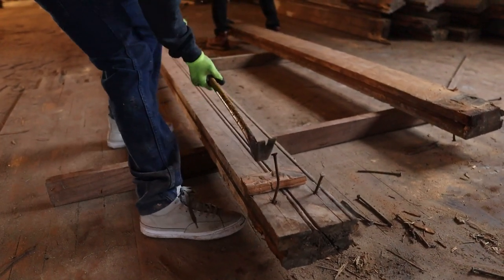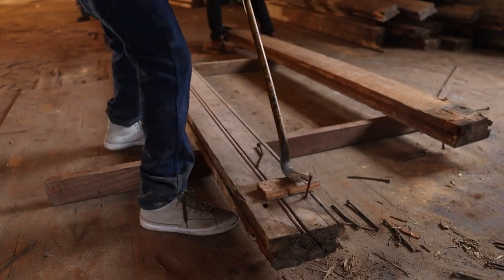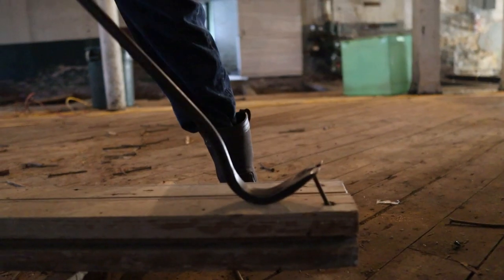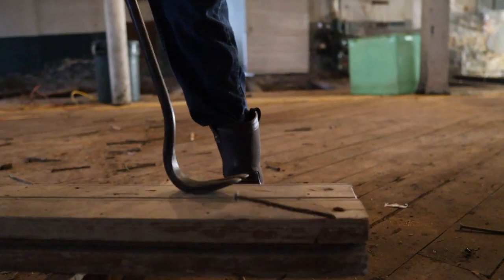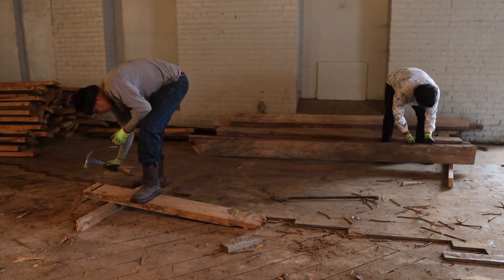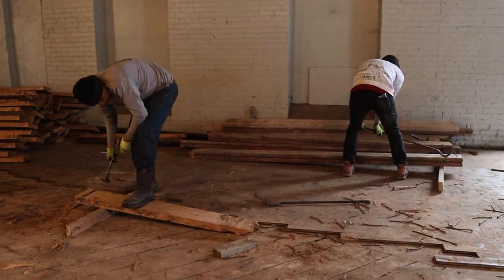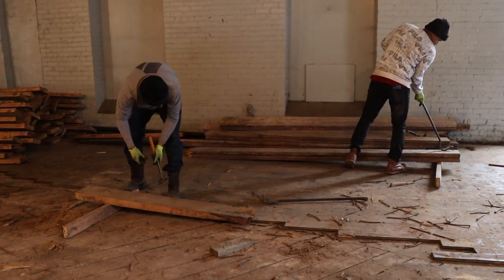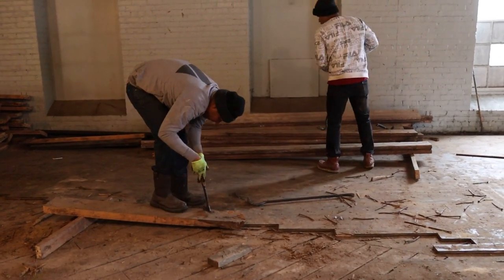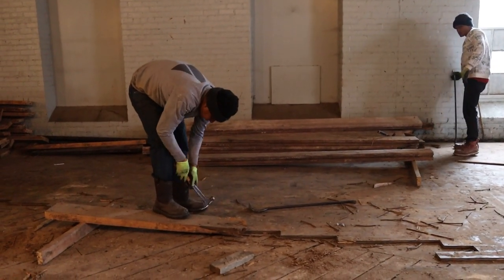Here you see the heavy timbers. These are 3.5. Well, we call them 4x8s. And they've got a nice bevel inside. That would be the face side of the board. And the spikes that they're pulling out, they're pulling them out first with 4-foot crowbars, and they're denailing them. So these things had 3/4-inch by 3-inch tongue and groove splines running between them, and then the spikes, and you couldn't just rip them up. They had to be very carefully removed so you didn't break the components of the material.